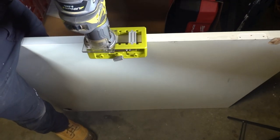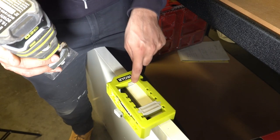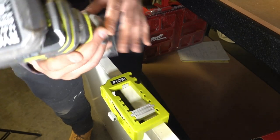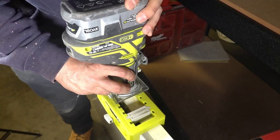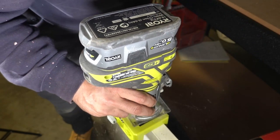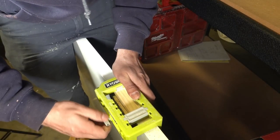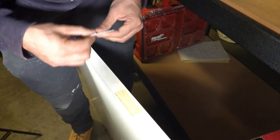Starting in the corner and working through with the router. Being a squared hinge there's not much to see visually, but it'll be interesting how well it gets into those corners. After routing, backing off and having a quick look — the corners aren't squaring off very well; they're already almost rounded.